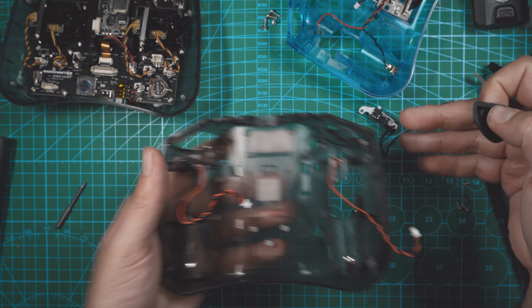So now you pretty much do the same thing with these pieces. You've got 6 screws for this main board, and it looks like that's probably just part of that, and then this antenna will come out. But this should all be one piece. The board right here, 6 Phillips head screws, and then you've got 8 Phillips head screws for the 2 gimbals. You've got 4 on this one and 4 on this one. Remove the antenna before you take this off.